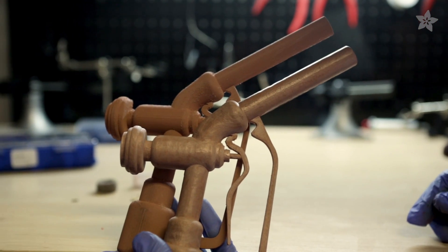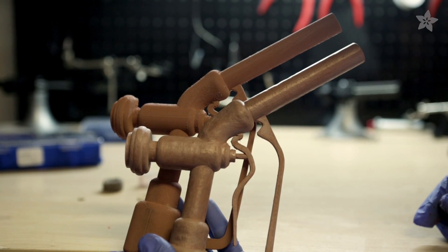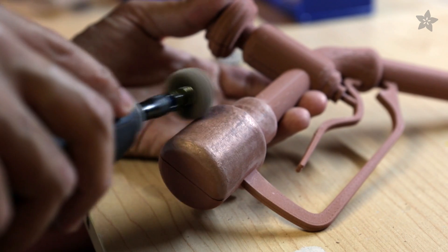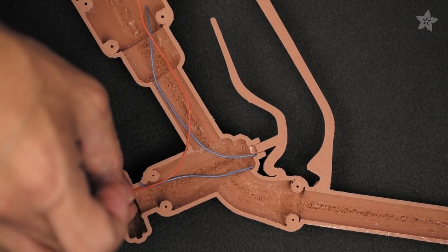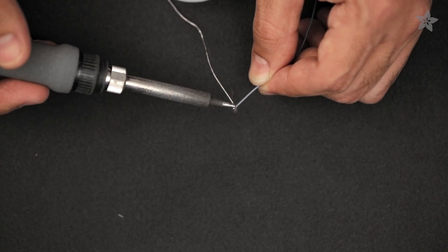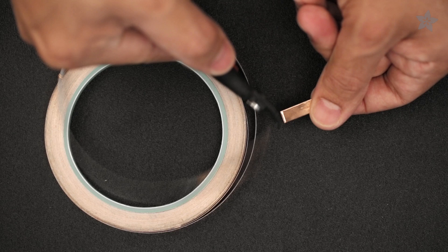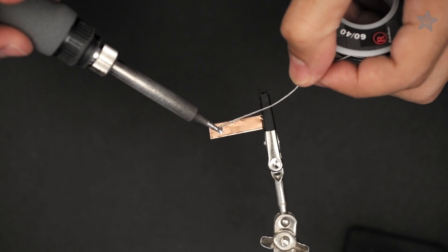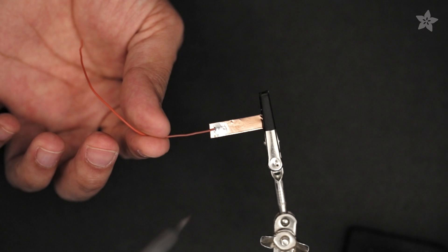Comparing the surfaces of these parts, you can really see how well the polished part came out. It's definitely worth the time finishing your copper-filled prints, and it's a great alternative to the rotary tumbler. To make the circuit, we'll start off by measuring three wires. We're using 30 gauge silicone coated stranded wires, and we're also going to use copper foil tape to connect the rechargeable coin cell battery. We'll cut two pieces and add a blob of solder so we can connect to the silicone coated wires.